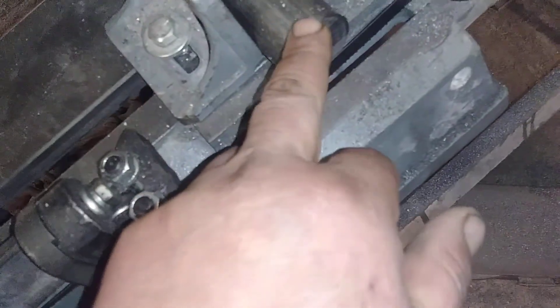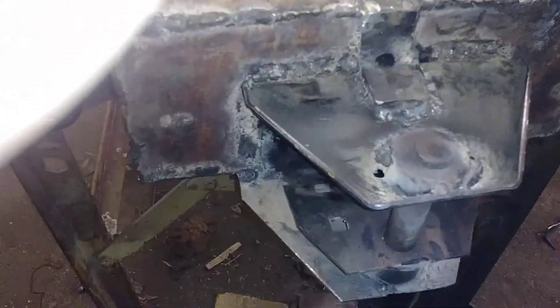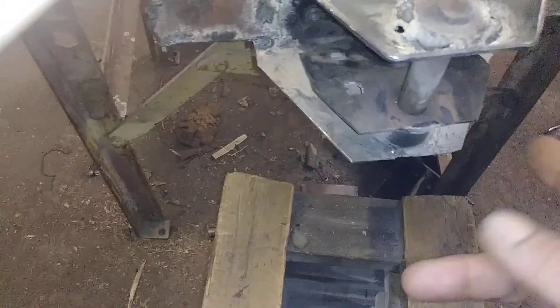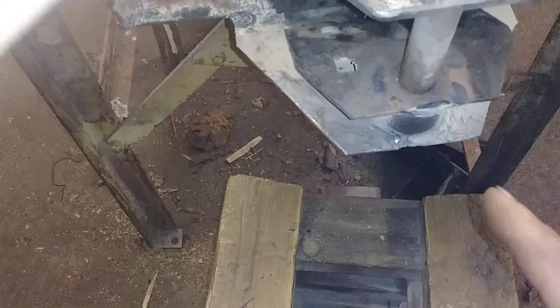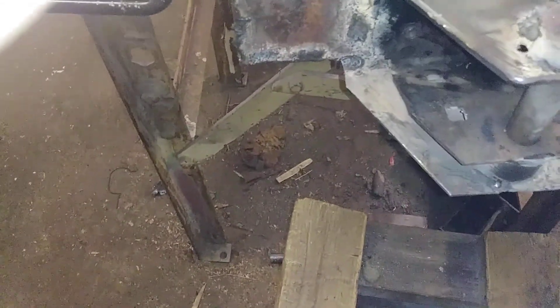This stock is about inch and a quarter or inch and a half, bored out on the lathe to make my bushings. A lathe is really handy for making bushings and so forth. There's a bushing there and a bushing down there, all welded in now - solid and strong. Three quarter inch pin, which is plenty for this little tractor.